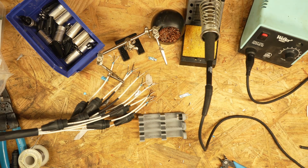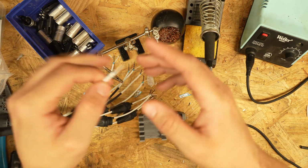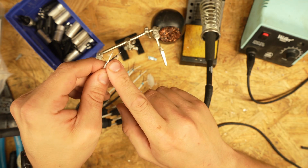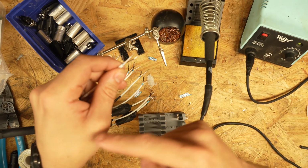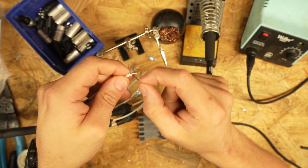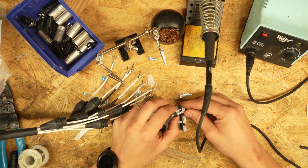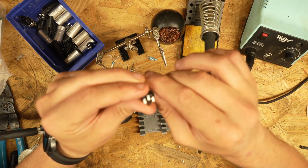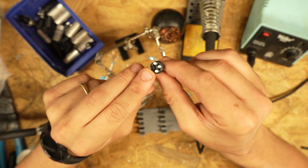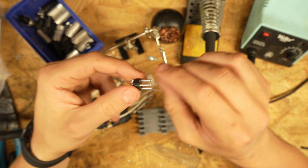Now, some snake cables, every single wire will have different colors throughout the entire snake, which also makes it very easy to identify. The important thing is that whichever you choose to be your positive and negative is the same on the other side of the cable. So in this instance, we're gonna go positive being white, negative being the black wire. So pin 2, that's our positive, pin 1 is our ground, and pin 3 will be our negative. So pin 1 here is at the bottom, and then you have pin 2 here at the bottom and pin 3 up here at the top.